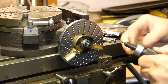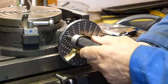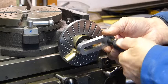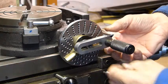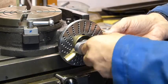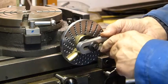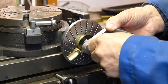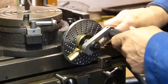The plunger now fits nicely on the end of the shaft. As mentioned, I had to mill the flats to make the bracket fit — I could have filed them, but it was just as easy to put them in the full-size dividing head and remill the flats, which ensures they're perfectly square to each other. It's quite nicely made overall.